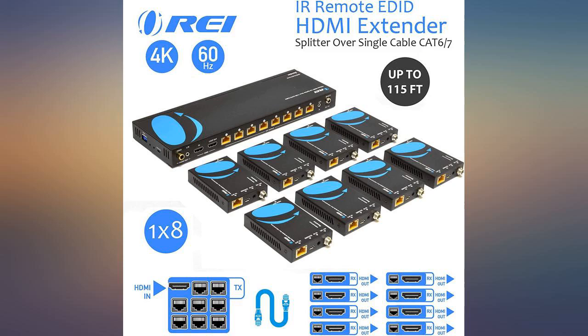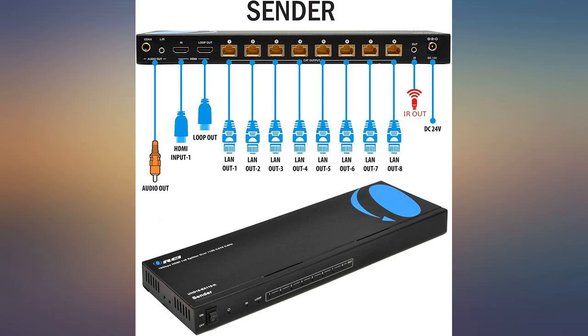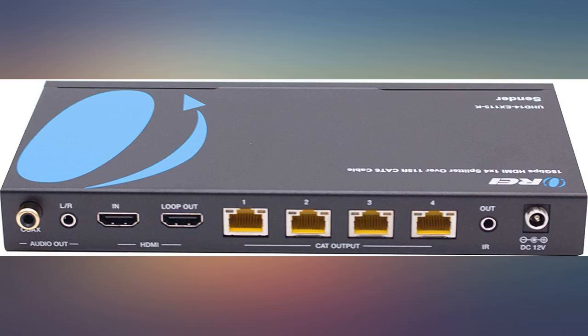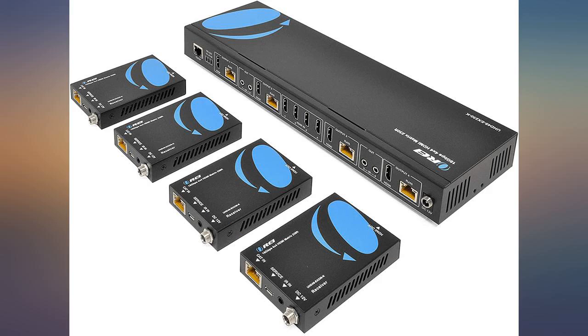The video output from the NVR is not high-end 4K, so you may need newer Cat6 or Cat7 for longer and higher-level 4K video projects. But I wanted to leave a review that the building's existing Cat5e cables punched down in a patch panel worked with the NVR. I did read one review saying it worked for Cat5e from an NVR, so I want to second that to help others trying to find an option over existing cables.